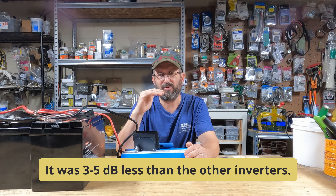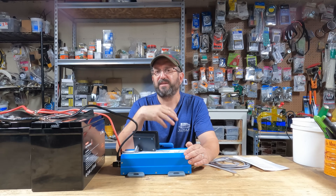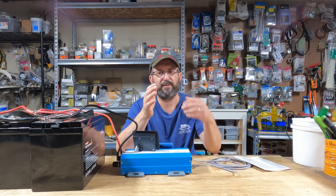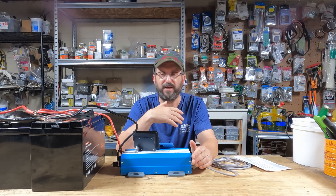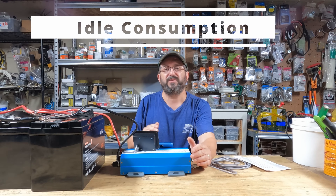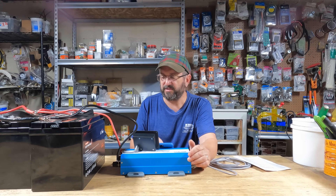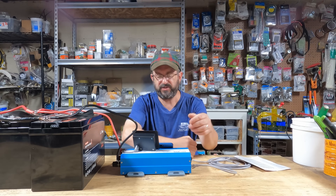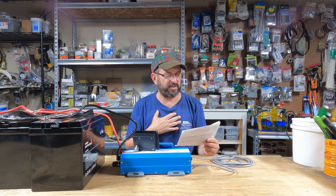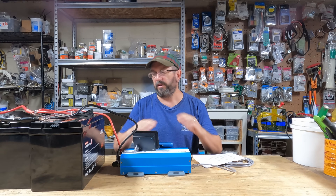They claim ultra-low decibel sound, but the sound on this was pretty typical — I wasn't able to duplicate that. And the surge capability, as I mentioned, I just was not able to duplicate that either, though I've never been able to get surge out of anything I've tested, so I don't know if that's really a reflection of the unit. But the unit performed incredibly well. If you're wondering about idle consumption, it sips electricity on idle — 3.9 watts is the idle consumption. Just incredible. Pure sine wave was clean, and the sine wave was pure even under heavy load.